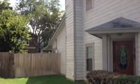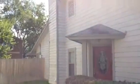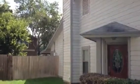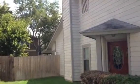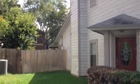It's a Ray Ellison home, so we got a lot of siding. You can see here the chimney's in bad shape. Basically, we're tearing everything off. We'll resheathe the wall with the 7/16" OSB. Come back on the top of that with our Tyvek. We'll do the seam tape, all the flashing.